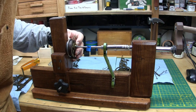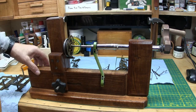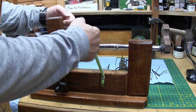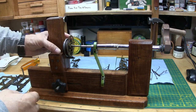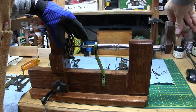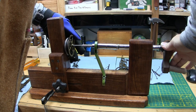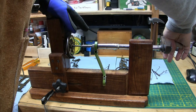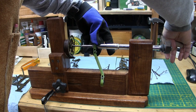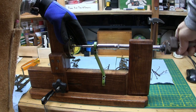That's a little high, so I'll put that in the next lower one. I use the same key from my let-down tool — it just slides right in. I'm going to tighten this up, take the retaining clamp off, then let the spring expand and remove it from the arbor. I have my glove on — it's better to err on the side of safety. If I let go it'll stop, so that's kind of like a safety. Now the clamp is free. I'm going to reverse the ratchet here and slowly let this unwind and expand at a controlled speed. Sometimes if a spring is gummed up it doesn't quite expand as it should.